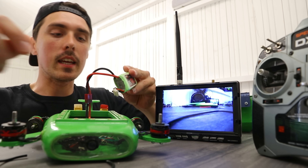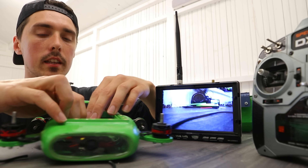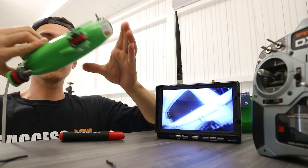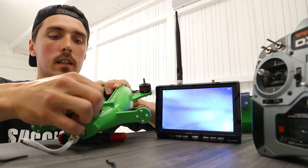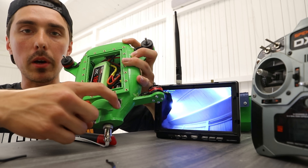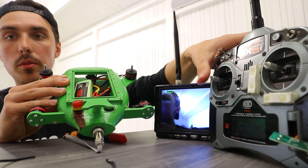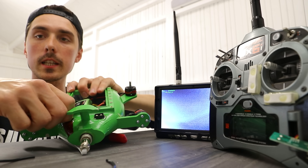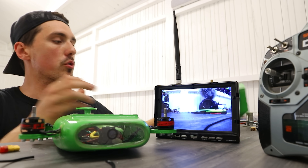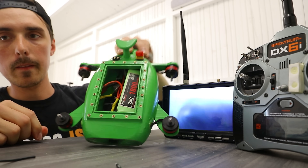I wasn't planning on routing the balance connector of the lithium polymer battery to the outside — I'll just tuck it in. You don't actually need the balance connector to charge a lithium polymer battery; you can just connect the charger to the positive and the negative terminal, which is why I have this connector here. You can see the negative and the positive terminal of the battery going straight to the battery, so I'll just plug in my XT60 connector. This is the on and off switch — if I give it some throttle the motors work, and if I unplug it it's now completely dead. The camera is still working because the power to the camera and the video transmitter is inside the flotation box, but if I plug it in it will turn on.